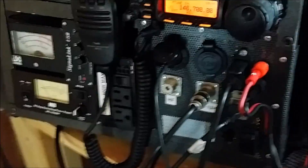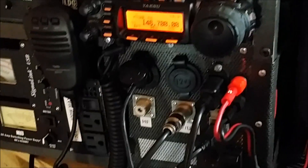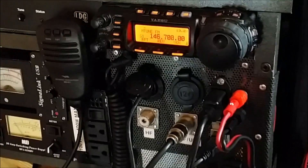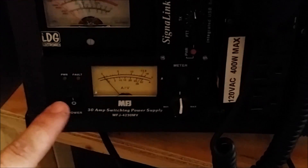The other panel that was up on the roof — the 15-watt one — is actually run into a separate charge controller. Its sole purpose is to power this ham radio. There are two 14-amp-hour batteries in this box that power that radio. It doesn't need a whole lot of charging current, and it works really well. I've never had to use AC power, though with the addition of this power supply I can if needed. The box also has USB charging and a 12-volt cigarette lighter plug.